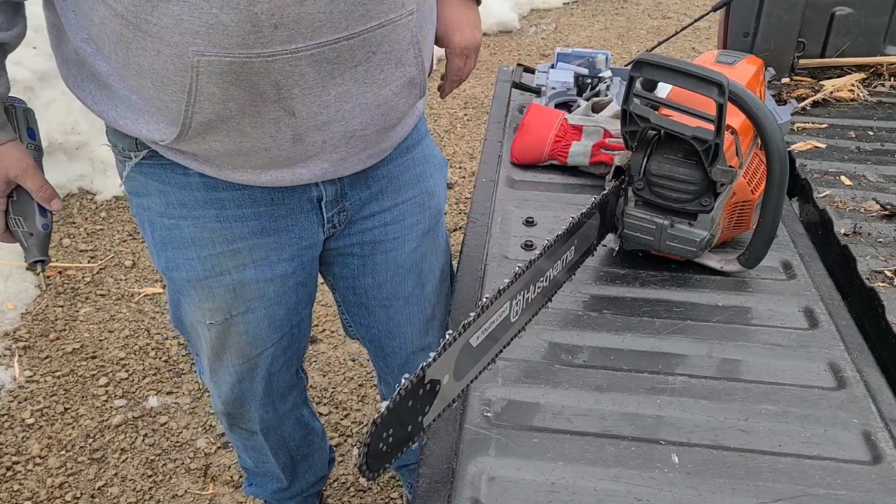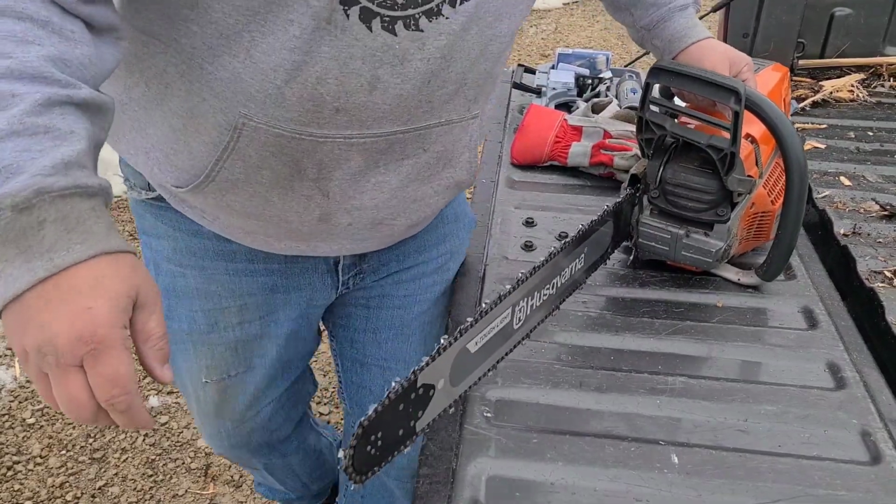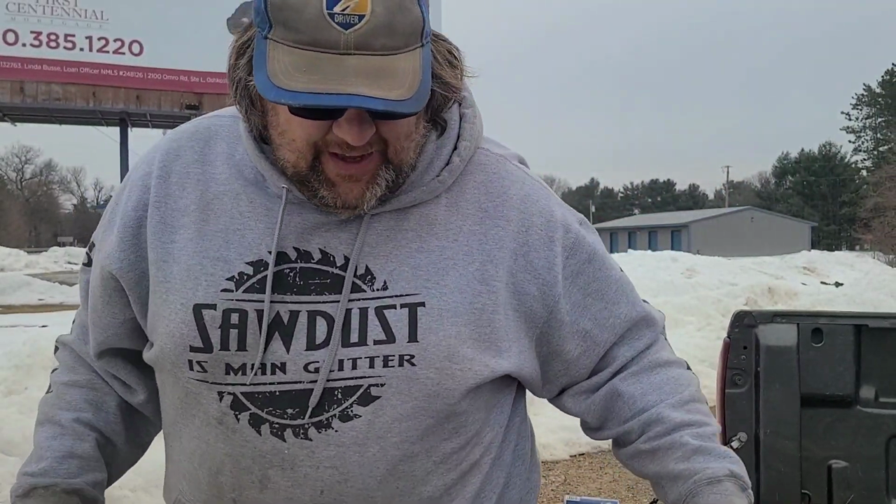There we go. That's how I prep a saw for cutting, and that's how I fix a chain in the field too. I took the rakers down last time I filed it. I did about a face cord and hit nails.